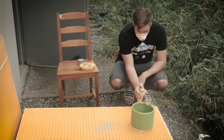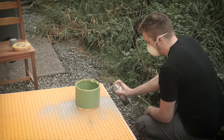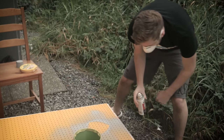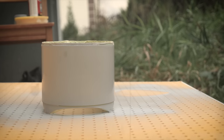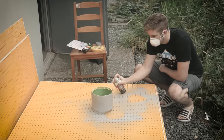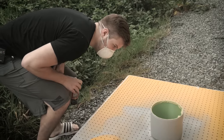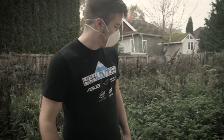That would be a huge waste of time. It's largely sanded down. This is filler primer, so hopefully that will help kind of fill in some of the grooves that are still existing and we can get going. One of the problems is that the clearances on these things are actually pretty tight, so I'm going to try to tape them off and then we'll be good to start spraying. That's a lot smoother — I can already tell. We're going to bring this in to dry again and then we might do it one more time.